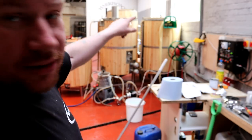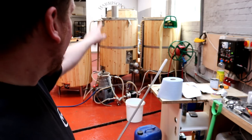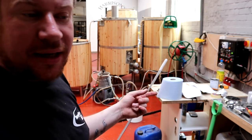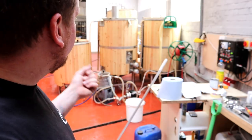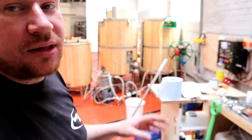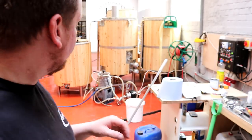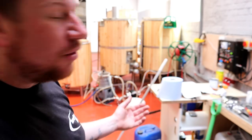I need to bring some 1-inch pipe work off the top of the fermenters and down the front, so I don't have to go up there to connect any spray balls or anything like that. I also want to have that running down on the front so I can connect a hose as a blow-off tube, because I've noticed I've got nothing there, no vent for a blow-off tube or an airlock or anything like that.